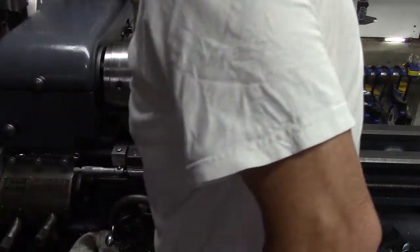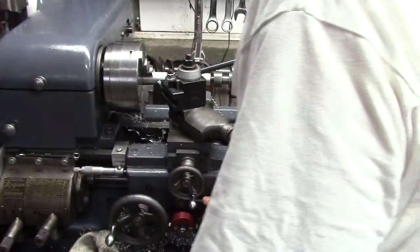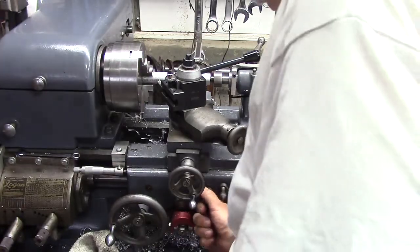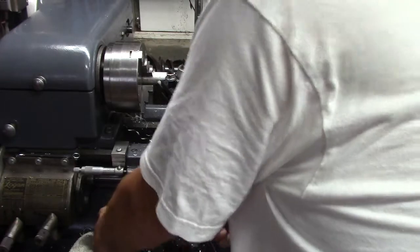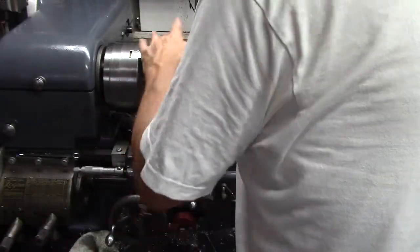Adjust the tension with my custom tension knob adjuster. Put it into gear. It doesn't go into gear. Rotate the chuck until it goes into gear. And then if we want the apron to move, this guy goes up towards the cross slide. It's like a reverse mnemonic. If it doesn't go into gear, then we move the apron until it fits. But we're good. And we've got it on a fairly coarse cut. And we're going to take it down to 0.8 inches. Here we go.